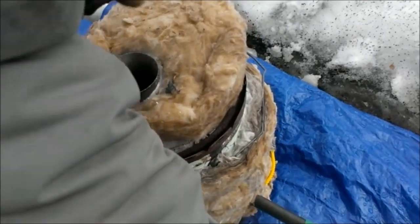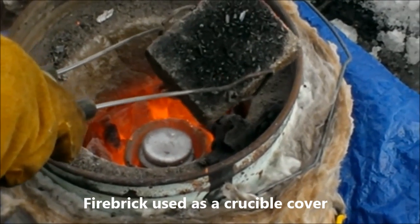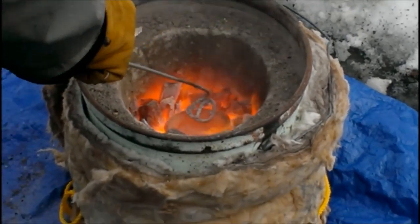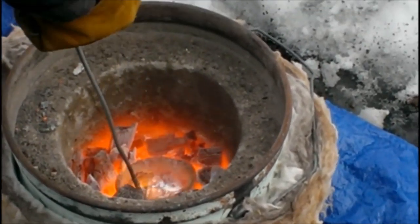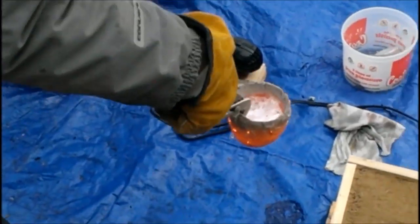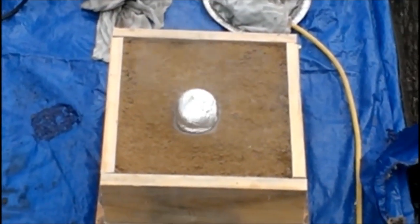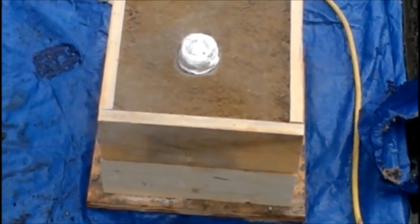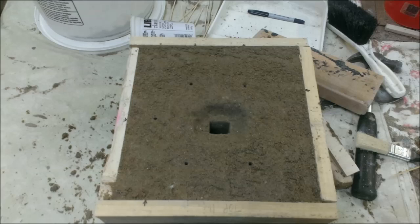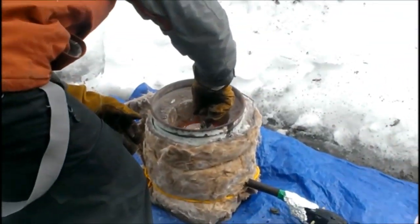Heat the furnace progressively with the crucible inside — this takes almost an hour. Pack loosely the crucible with small pieces of aluminum scrap. Continue to heat the furnace until the aluminum is melted. When it is, a layer of oxide always forms on top; scrape it with a steel stem until the aluminum is clean. Make sure the aluminum is very hot — very liquid — before pouring into the mold, about 100°C above melting temperature, to make sure the liquid can make its way into the mold pattern before solidifying. A bubble had formed on top of the mold because there were no vents — the air couldn't escape elsewhere than the sprue. On the following pour, I added the vents, and it made quite a difference — the aluminum just flowed in. The resulting parts were also better.